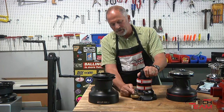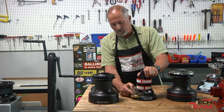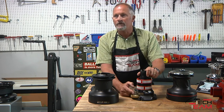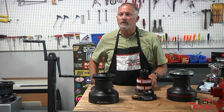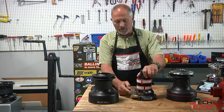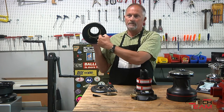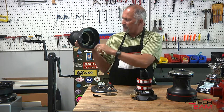Winch grease should be used only on the gear teeth. For a boat or a racing boat, you might want very little bit of grease on there. You don't want to run them dry because it may spin better dry but it's going to load up and cause some wear. Make sure you have winch grease on the gear teeth.